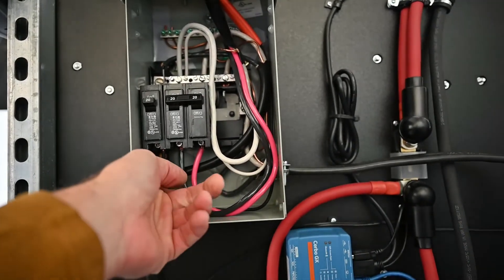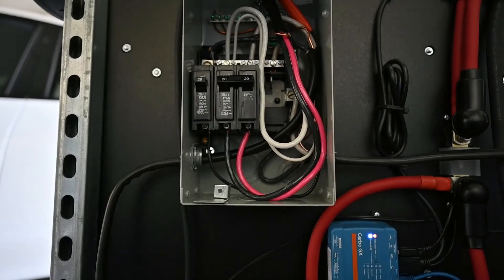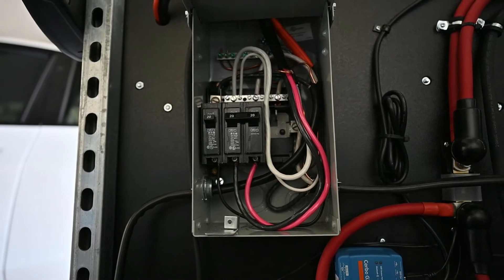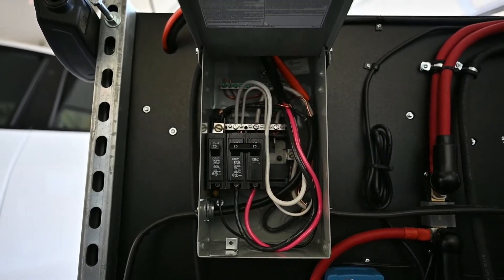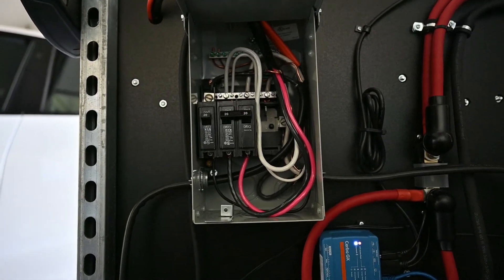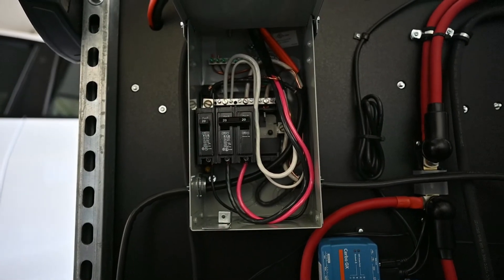There's no actual need to have this thick a gauge wire, but it can definitely help add a few volts when you're charging at high current. Overall, this system can't draw more than 20 amps at 240 volts, which is 4,800 watts. I will basically never run the inverters that high, even though they can do it. I hope that answers some questions on how this is all hooked up — go ahead and tell me what's wrong, if anything. Thank you.